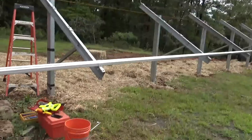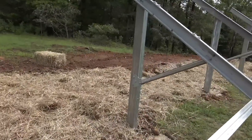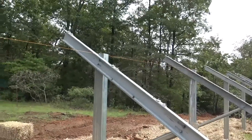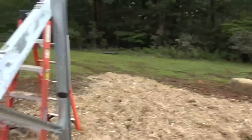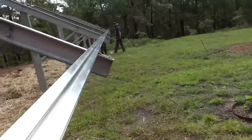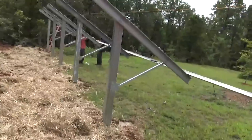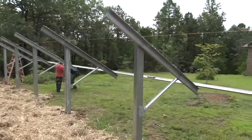It's Powerpeak day two after a very heavy rain — we're grateful the concrete truck made it in. The strut system — the girder and strut back to the post — has lots of adjustability. We're basically just letting them hang and sit down so we don't need much adjustment. They are planing out really well. The girder is up in about 30 minutes.